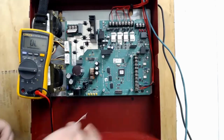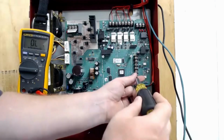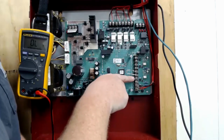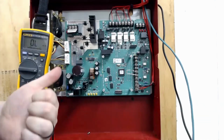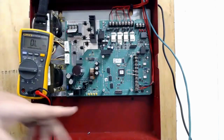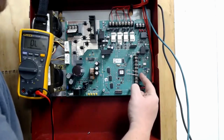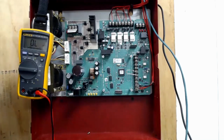So I'm going to set that out of the way. First thing I'm going to do is take my resistor and bend it into a horseshoe shape so I can land it on output 1, positive and negative. Because what's going to happen is I'm going to come out of that AB positive and negative and land on input positive 1 and input negative 1. If this panel is ever in trouble, which if I were to turn it on today, it would be, first because it's bad, it came back from the field as a bad panel, but second, we know we have that open NAC circuit on NAC 2. There's a relay in here that can physically disconnect and connect the circuit from input to output right here. So if it's in trouble, it disconnects that, which disconnects the module from its end-of-line resistor. And that's how we know when this panel is in trouble.